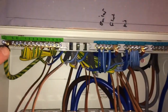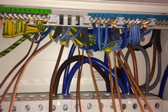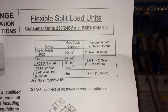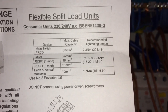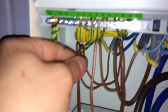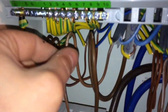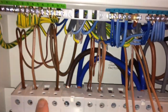The live cables are left out and going to be going into these breakers. They've got all the CPCs and neutrals in. I go around and check every terminal — even the manufacturers' ones. If you read the data sheet, it tells you the recommended tightening torque with your torque screwdriver. We're not doing that today because these are all coming out again for testing. When making these off, make sure you bring them up and then down to give yourself a bit of play on all the cables so you won't leave yourself short.